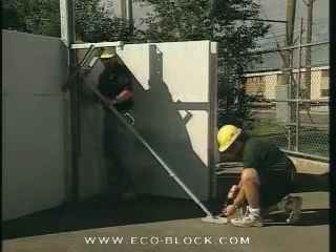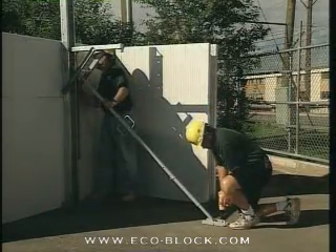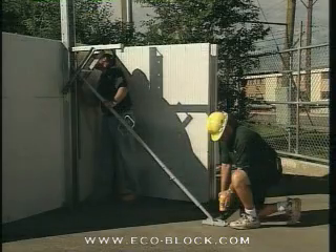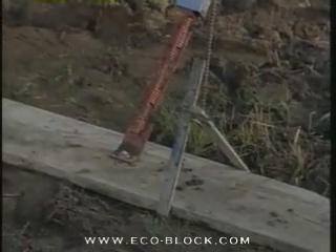The kicker's foot is fixed in place with either nails or tap cons on concrete, or with stakes on soil. Keep in mind that if the kicker moves, your wall moves out of plumb. On soft soil, set a 2 by 12 first to help distribute the weight and give the foot a sure fixing point.